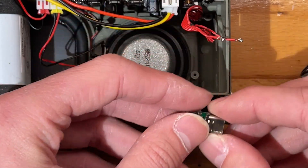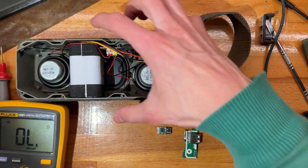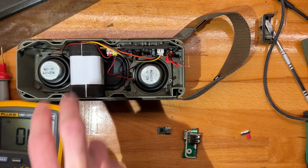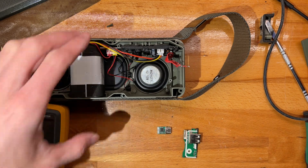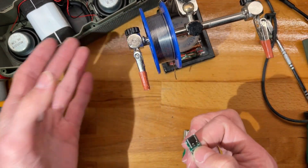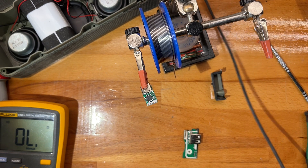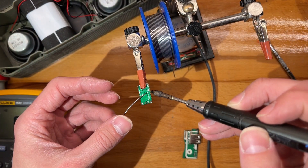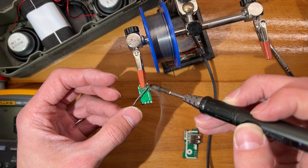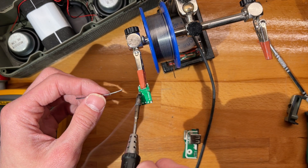Basically I'll just be connecting this and finding a way to glue it in, and then I'll be done — there's only so much time you can invest in something that cost 30 euros. I'm already up 10 euros on this because the battery pack alone is very nice. I also like to flood the Type-C connector with a bit more solder because they're always stingy with it, and I really don't want this breaking off again.